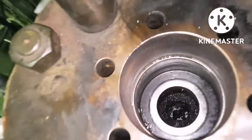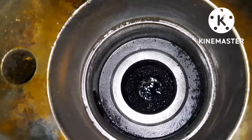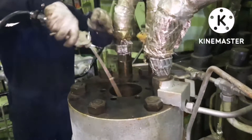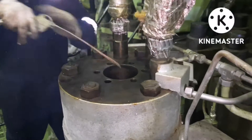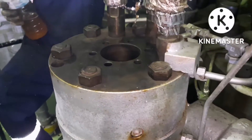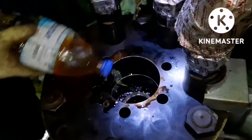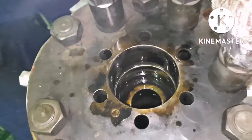So we are cleaning it. During inspection you have to check for any damage on the surface — any pitting mark, any scoring mark — all those things we have to check. Next, blow air, and once blowing is done, use diesel oil again to clean the suction valve surface area. Diesel oil is a very good cleaning agent when doing maintenance on heavy fuel oil machinery.